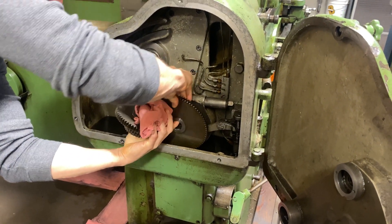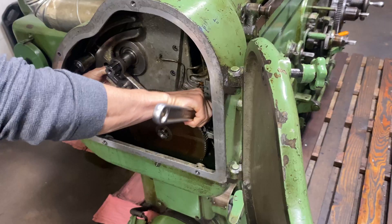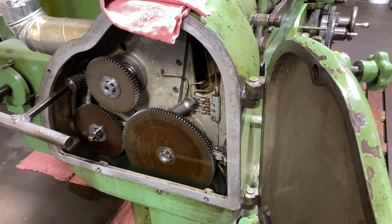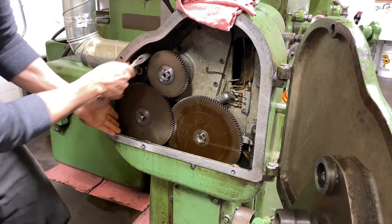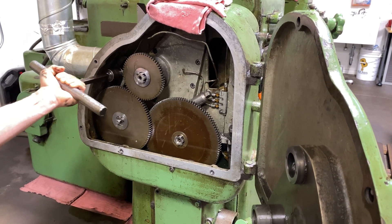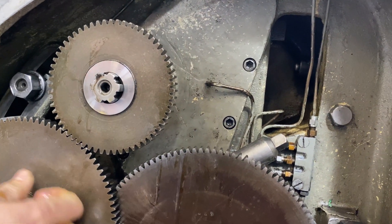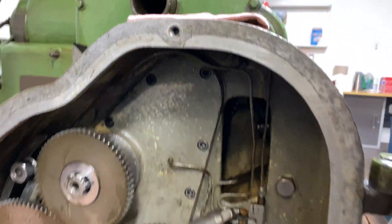The first thing we're going to do is come in here and change the change gears. The design of this worm gear set is such that you set these change gears to give you the right helix angle and right lead, etc. The four-gear method — we've covered a lot on the channel in terms of gear machines. They have a kind of universal transmission with gears A, B, C, and D. You can get some very specific ratios out of it, and that's why they're used.